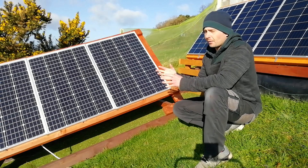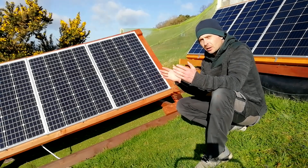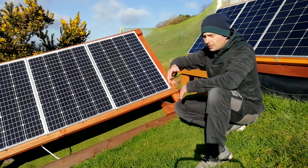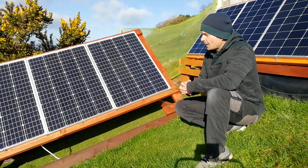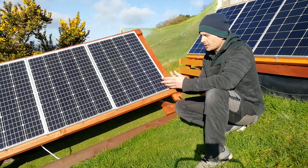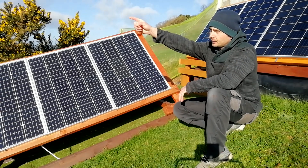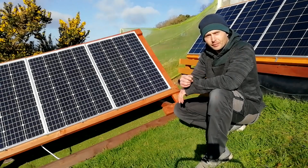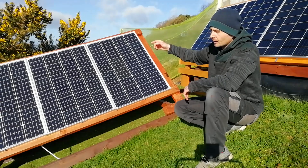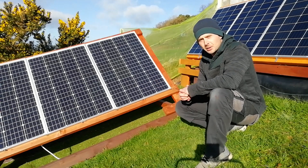The reason I've got them laid out in a 90-degree configuration is purely to follow the sun across the sky. The first three catch the morning sun as it rises behind us, and the five behind me catch the midday and evening sun as it tracks all the way over the other side of the valley. If you only have one set of panels facing one direction on a fixed frame, your peak charging time is only going to be maybe an hour or two every day. If you can set up a rotating frame that follows the sun, happy days. Light availability will also change depending on your season and location on the planet.